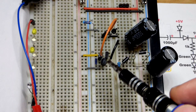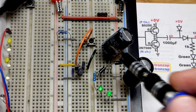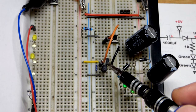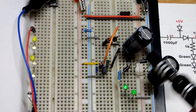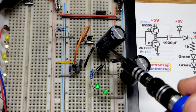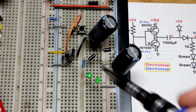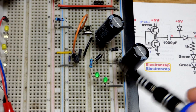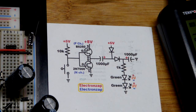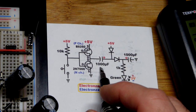We're focused on charging the capacitor right now. Most of the time it's connected to ground, so this capacitor is charged. Now when we switch it so that it connects to the positive supply, we have the charged capacitor there with positive here, so that puts them in series — their voltages add up. It goes in this direction because this capacitor is headed to ground. We have positive over there, so its voltage goes up, but then it also has to power the load.